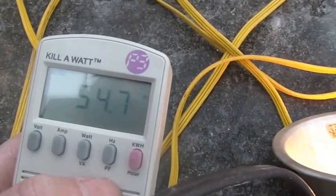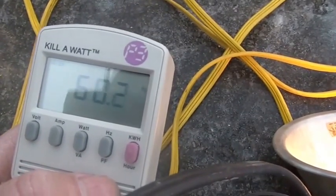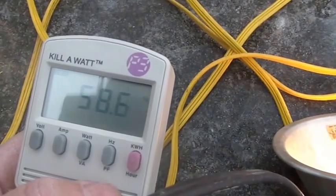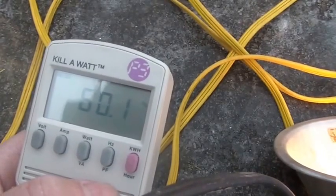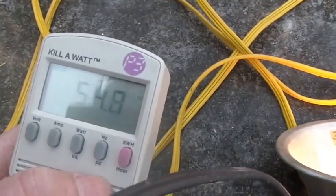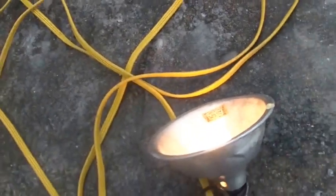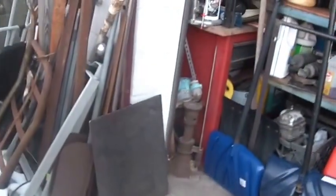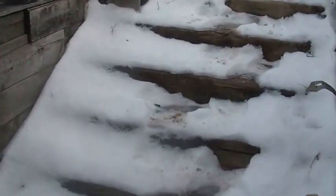I am a little concerned that the frequency is moving around a bit — it seems to go from just over 60 Hz down to 55, 53. So not too bad, but I'm going to let it run. There's really nothing worse you could do for a generator than letting it sit around for long periods of time without running.